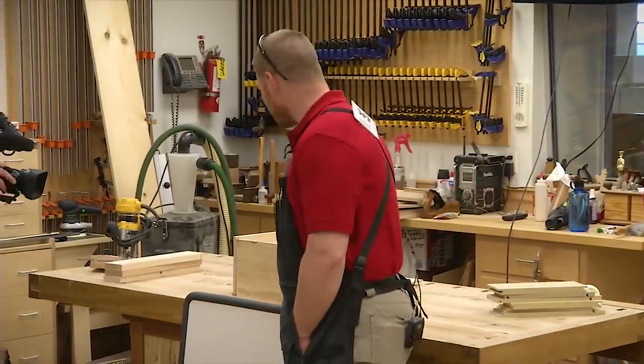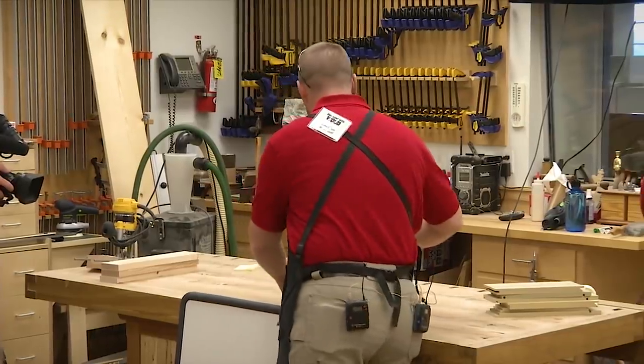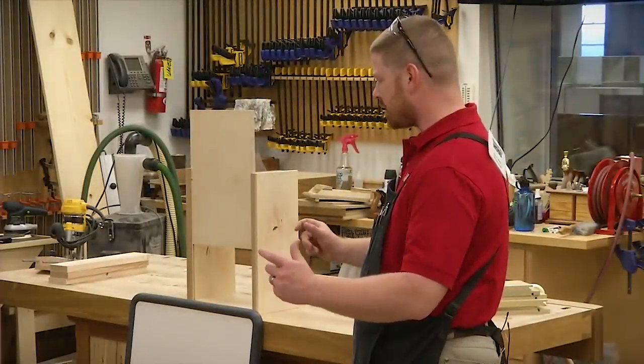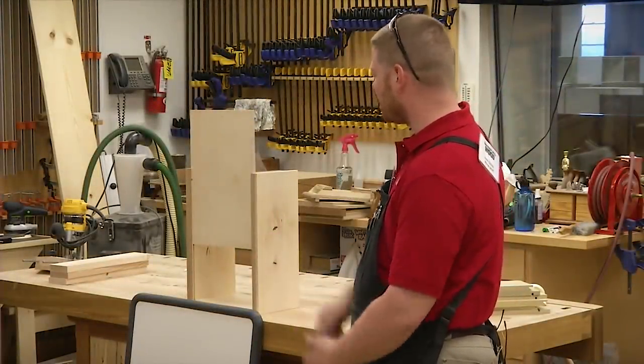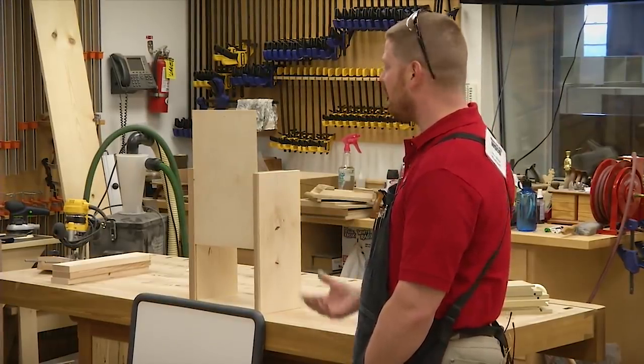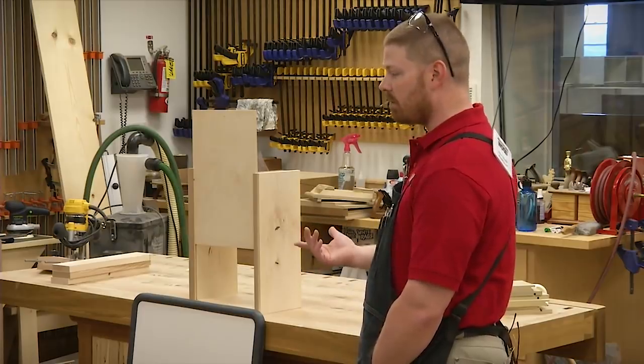So that's why I put these wear strips on the bottom. On this particular one, I used white oak because I have white oak. Another good alternative would be hard maple. That'd be something hard that slides easy. I've gone a little extra here, as I'm sure you've seen on the drawer I passed around. It sticks out the side. It's tongue and grooved into the drawer side. You could just glue on an 1/8-inch wear strip on the bottom if you really wanted to. Another strategy is just make it out of whatever you want.